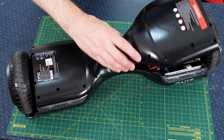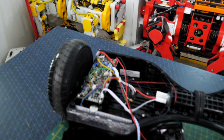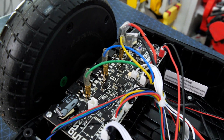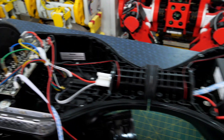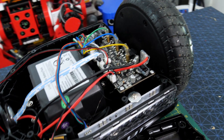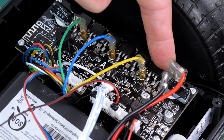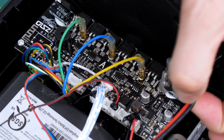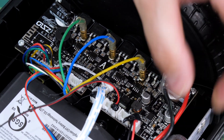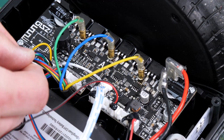Let's see what's inside. We've literally got two balancing robots next to each other — there are two circuit boards which look fairly identical. There's a board with B on and a board with A on, which have all the things you need including power distribution and a sensor for the angle. Those are the motor drivers, and we can see wires going in for power, plus the three green, blue, and yellow wires to the motor, and also hall effect sensors going to those hub motors built into the wheels.